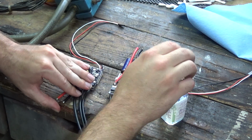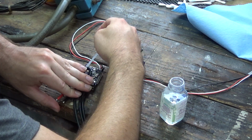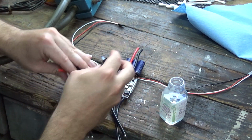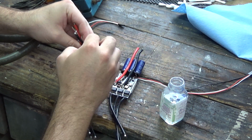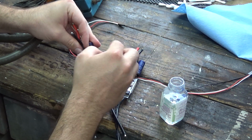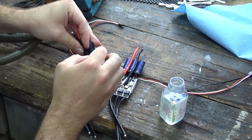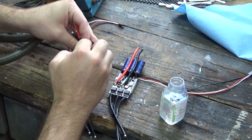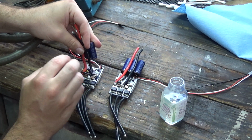But yeah, you just brush this stuff on, let it dry, and it prevents shorts because of moisture. And if you need to solder anything on, this stuff will actually just melt away with a soldering iron. I forget how expensive I bought this bottle a while ago. It also leaves a cool UV coating. Watch, there's probably some reason why you shouldn't be putting this on your ESCs, and someone's probably commenting, no, don't do that. And then later on I'm going to smoke these.